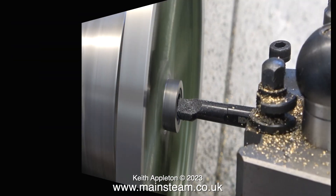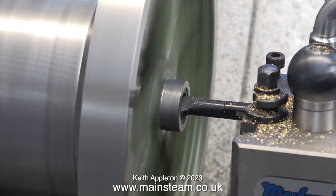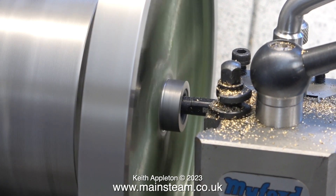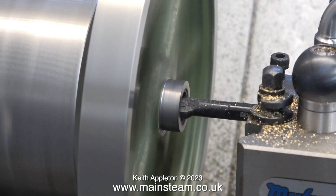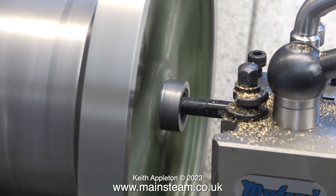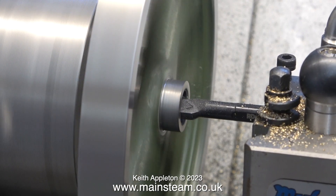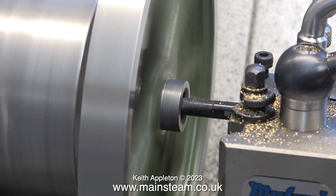Because the flywheel is only held by the centre boss, I have to take very fine cuts. I have the flywheel running as true as I can get it. And how did I do that? I used a soft hammer. When the flywheel was mounted on the mandrel, as I've previously shown, this was as concentric as I could get it to run. I'm using a sharp boring tool — it is also a negative rake boring tool, but it's doing the job quite well. Because the cutting tool slopes, you have to put a little bit more pressure on to get the tool to go through the work. And once again, I must stress that as the flywheel is held in the chuck only by the boss, I need to take very fine cuts.